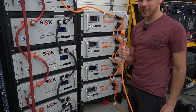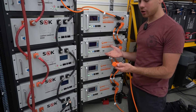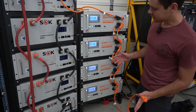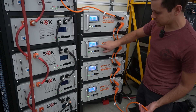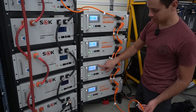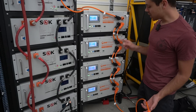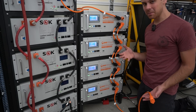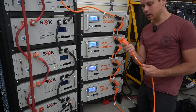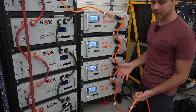I've never used these connectors before and I don't think I like them. I think there's an issue with how they share current across this pack when the batteries are in parallel. Today the state of charge is 86%, 85%, 99%, and 99%. Yesterday these two were at 99% and these were at 75%. I checked the current going between them and it seemed consistent, but something funny is going on. They feel high quality but I don't think they're thick enough for this size of battery connected in parallel.